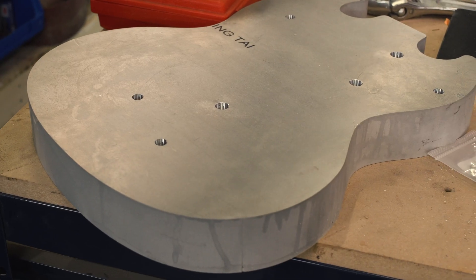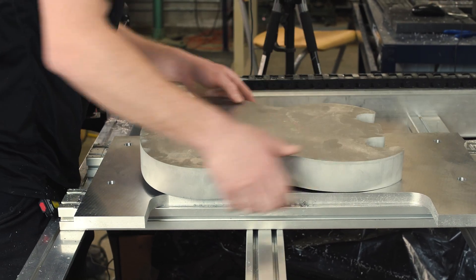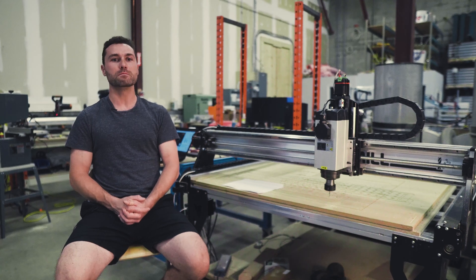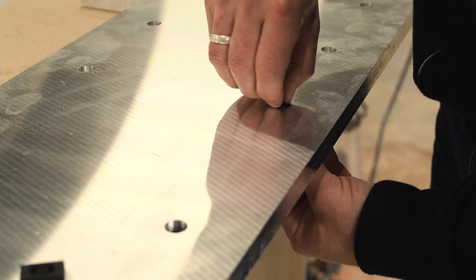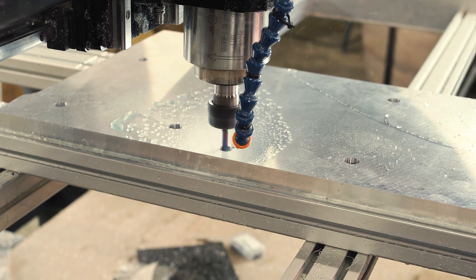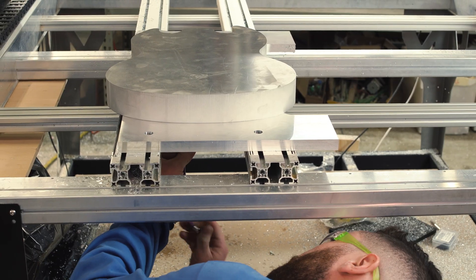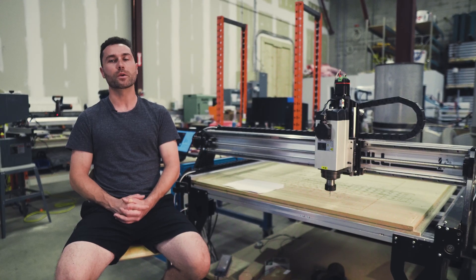We started with a two-inch thick aluminum blank that we got waterjet cut locally in the rough shape of a guitar, with a bit of extra material around it for cleanup and error margin. From that we milled an MDF pocket in the bed to roughly reference the guitar's position, then milled locating and threaded holes at the bottom of the blank. This let us make a fixture plate from aluminum on the bed and mount the blank from the underside, giving us full access to the top without interference from clamps. Because of the odd shape, our only clamping option from the sides would have blocked full top-face machining.